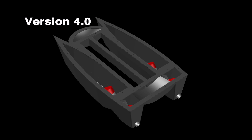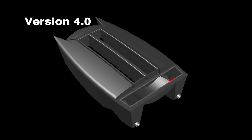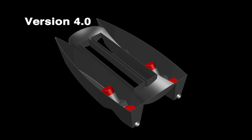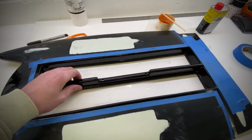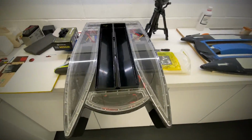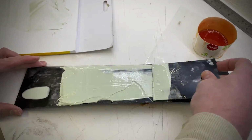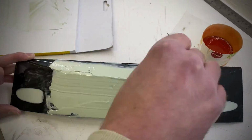This included me keeping the main section with the lips sealed to the hull, but required me to cut up the original lid to build sections that would fit the new flanges that sealed the boat. So it's back out with the Dremel to cut up the sections of the lid to start building the new sections to seal the boat. Here I'm just tidying up the deleted recesses from the rear section with some more fiberglass and car body filler before gluing that section to the rear lid flange.